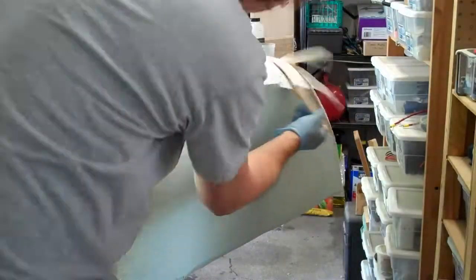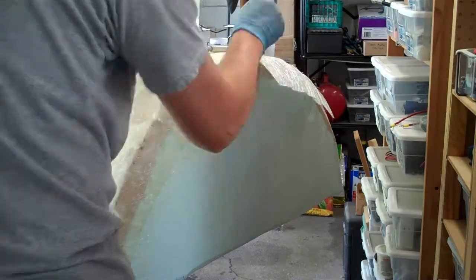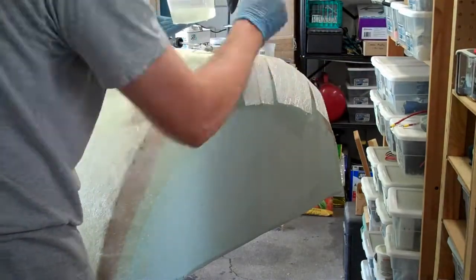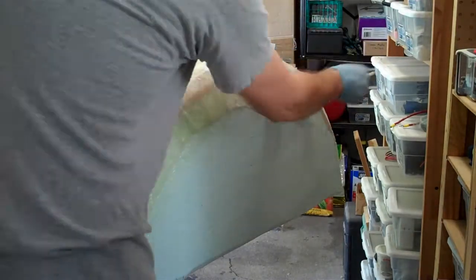To go around curved corners, you need to cut many tabs then fold them over on top of themselves. Once wet with epoxy, the chopped strand mat will go around corners, and once the epoxy gets a little tacky, it will hold the fibers against the next surface and hold the bend. I've even successfully done this procedure around the nose cone and tacked to an upside down surface.